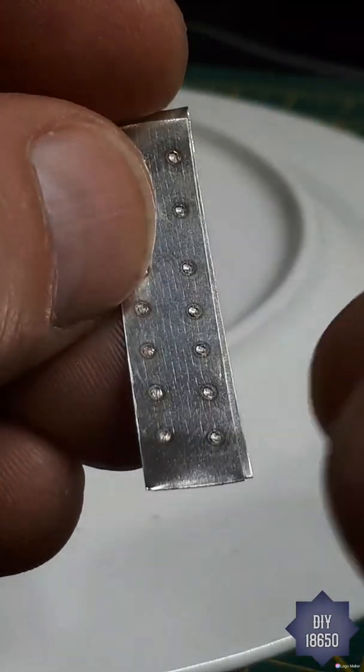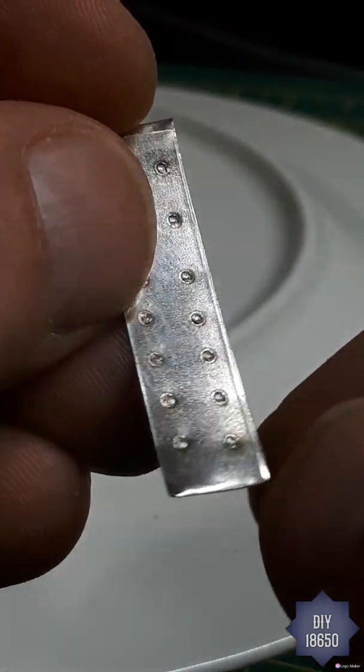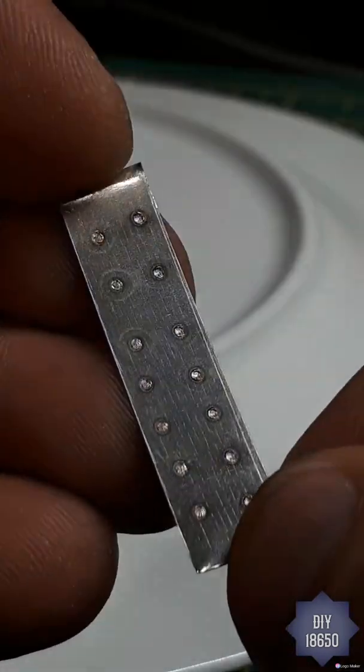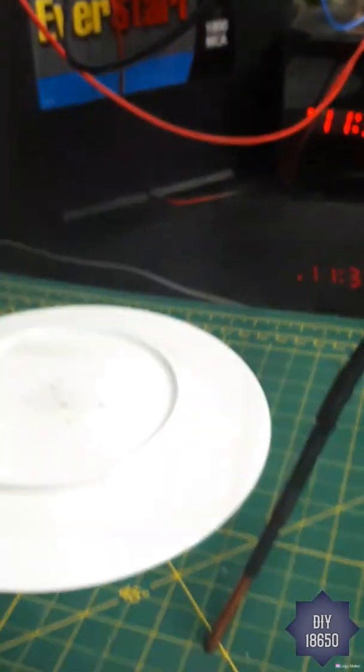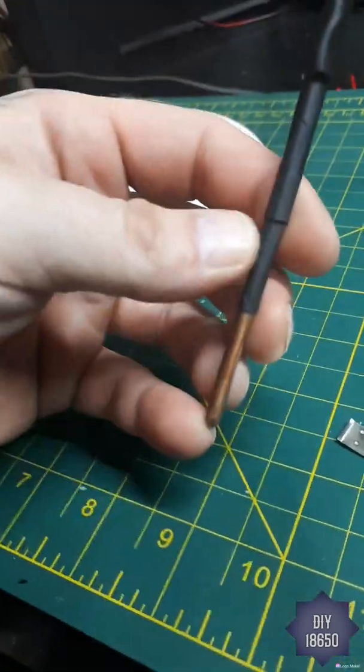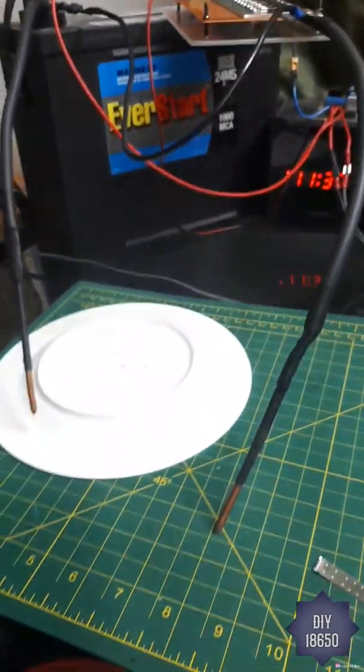For me this is absolutely perfect — I'm tickled pink with this. You need to see a nice weld pool but you don't want to dimple on the inside of the 18650's negative. There's a fine line — you don't want too much heat either. Bang off a couple quick welds and it's just like soldering. I should really switch my tips out for something harder. Here's the 12 MOSFETs on my 800 cold cranking amp battery.